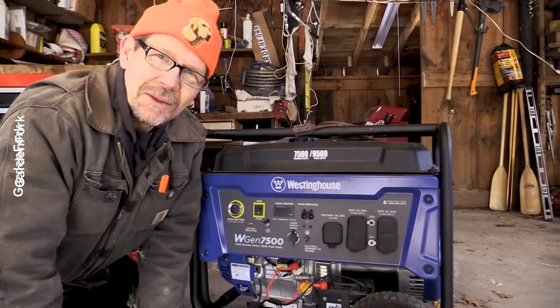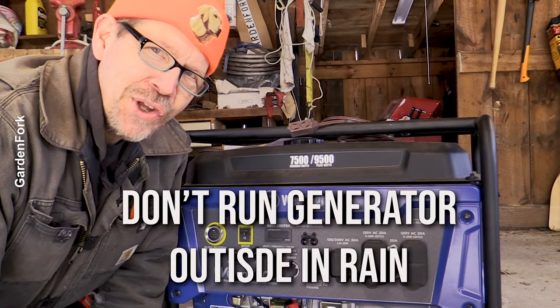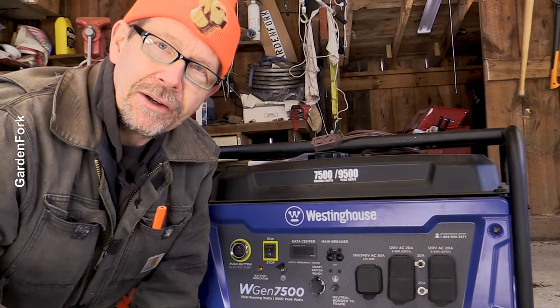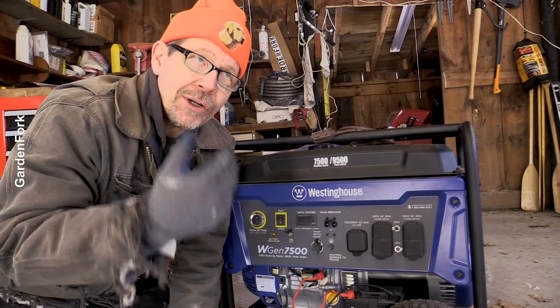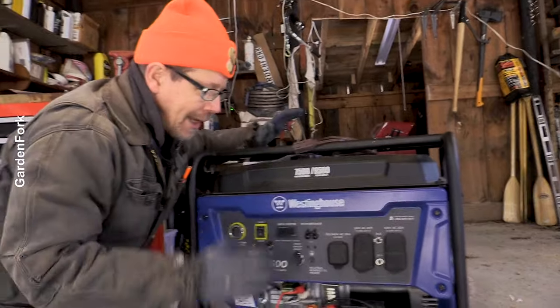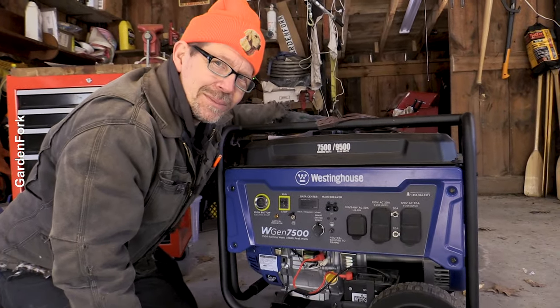There was a question from the camera operator: can you leave your generator out in the rain? No. Water and generators don't mix, generally. So if it is raining, turn off your generator. Ideally bring it into your garage once it's turned off. If you don't have a garage, maybe put a piece of plywood over it and then a tarp. You don't want electricity and a gas-powered engine out in the rain.